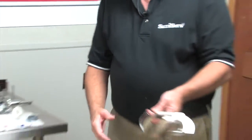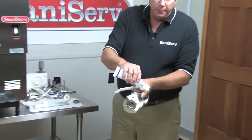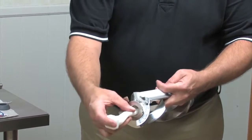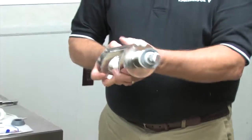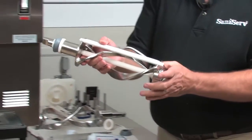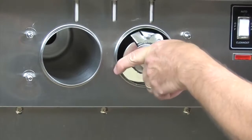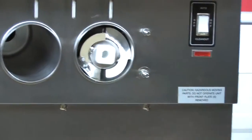Grab the stator rod. Also a little bit of lubricant behind the square head and just a tiny bit on this tail piece. It goes into the dasher assembly. Then I'm going to put this blade on top so that I don't have to fight getting into the barrel. Hold on to the stator rod, come up to the barrel, insert it all until I feel it stop. Then I'm going to, while holding on to the stator rod, spin this until it engages. That side's ready to go.